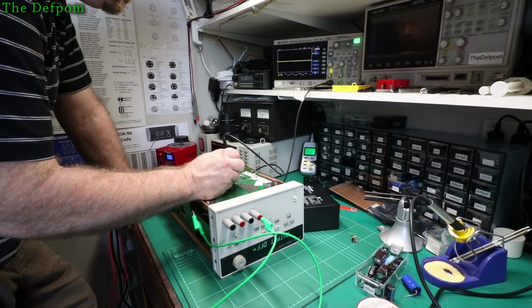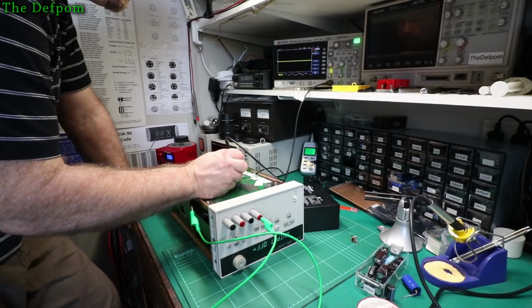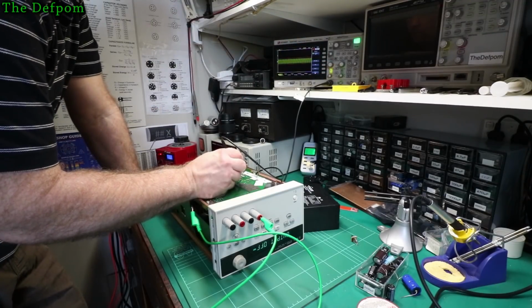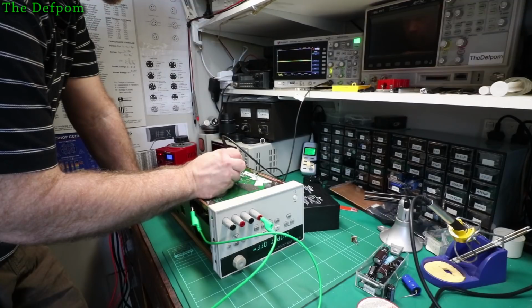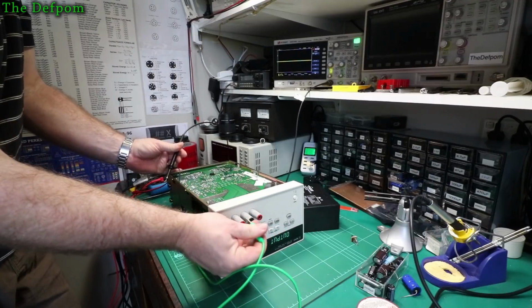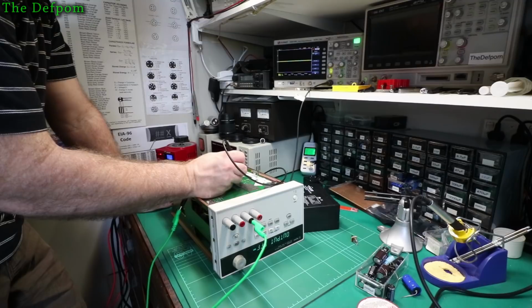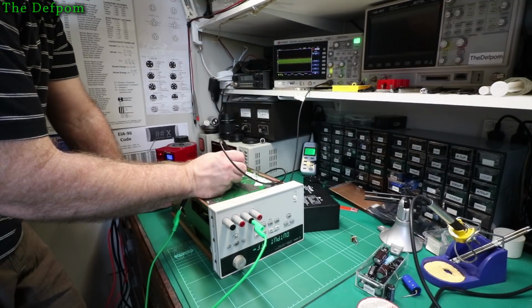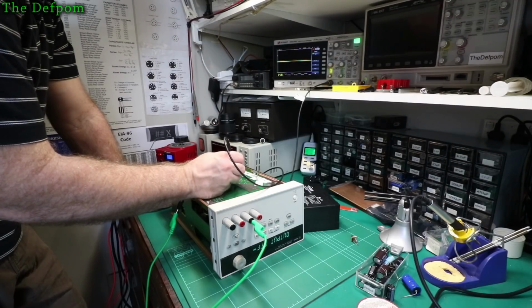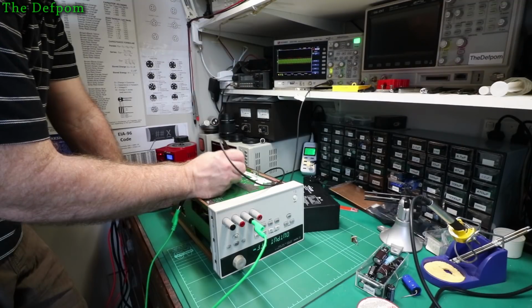Almost nothing near. 240 millivolts. 480 millivolts on that one. Let's just try going onto this one, just in case. I'm pretty sure it was tied to the positive reference though. Yeah, it's pretty much the same. So that C158 is also looking a little bit too noisy for my liking.